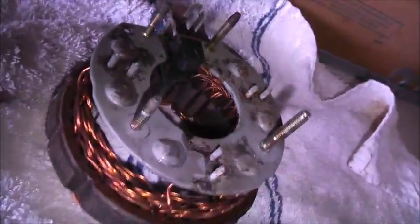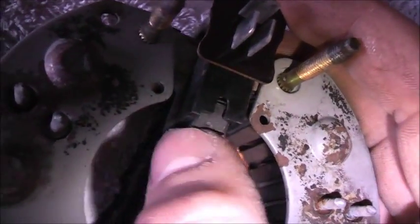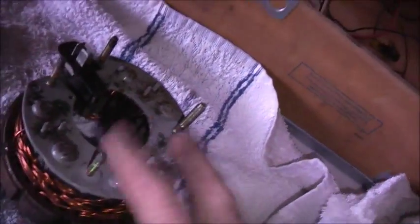That's a pretty beefy soldering iron, so I just desolder all these off. Hopefully I've got a spare set of brushes for this somewhere — there's still be enough left in it, not much though. Interesting diode arrangement — one diode there, diode there, and diode there. I'll see if I can retain this diode rectifier and rectify this real round motor with it.